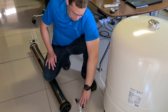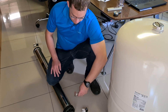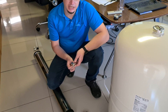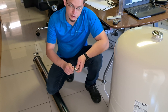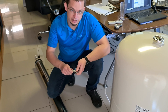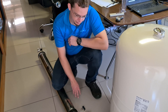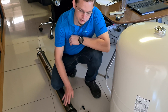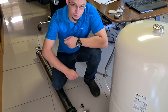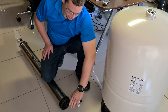After that you want a valve to control your waste water flow. Typically on slightly smaller units we'd use an adjustable valve like this. Really, any valve that takes quite a few turns to go from open to closed should work, because all you want is to be able to fairly accurately control the amount of water flow going to drain. Ideally you'd put a flow meter on this line and on the product water line, but in DIY setups people typically just tune them once until correct.